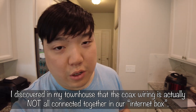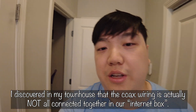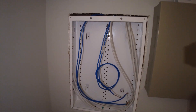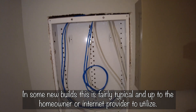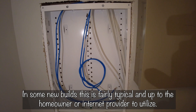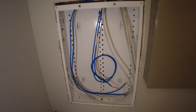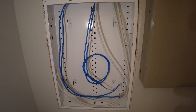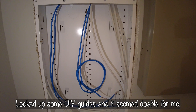Normally, all you have to do is connect one adapter to your router and one in whatever room you need, then plug in the Ethernet. However, I discovered a problem: in my broom closet, I found the on-Q networking box, and the coax cables — about four or five of them — are all just cut and not wired to anything. The phone lines are the same. So I'll need to DIY the coax termination myself.